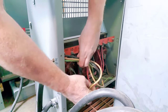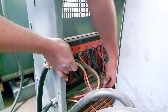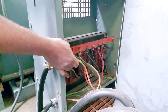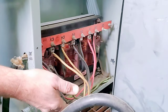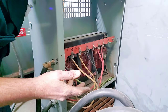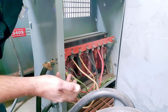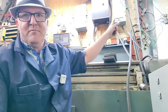The wire coming in here — I've got this white one coming up to X3, this red one coming up to X1, and X2 is the other side on the inside. If you were to wire this up backwards it would step the voltage down even further, which would also increase your amps — but that's a different lesson requiring an electrician. From this transformer it's going to step up your power to 600 volts from your 240 volts, and then these wires come up to the box.